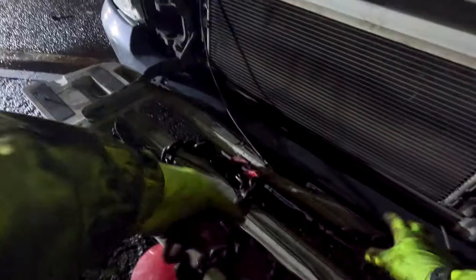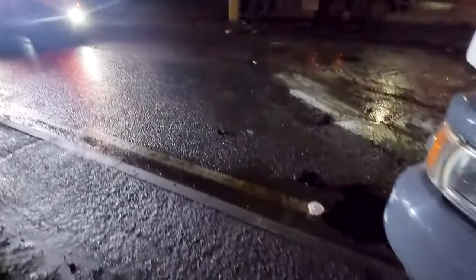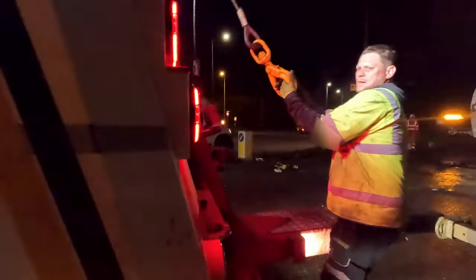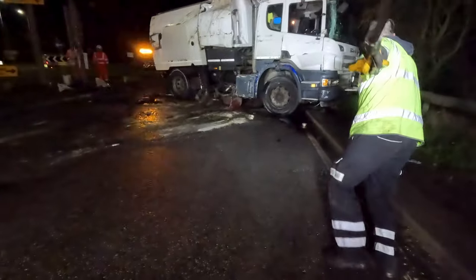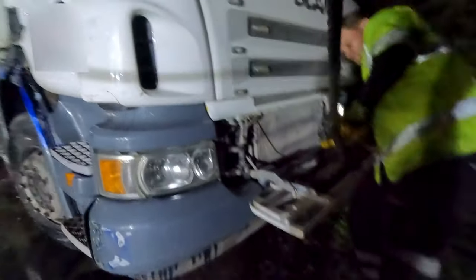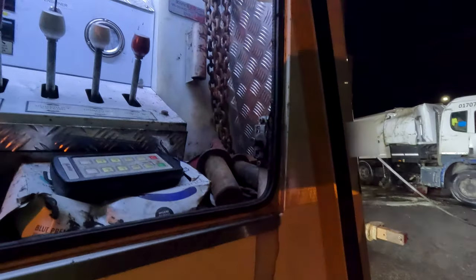Fortunately in this video it came over quite nice. It took air. The suspension wasn't great for some reason - it sat a bit skew-iff. But it was only going about 15 minutes down the road. One additional thing we had to do: when it came around the roundabout and flipped onto its side, it actually skidded across the road - which was actually handy for the rollover. But before we could bring it forward for recovery, we had to drag the front end around. Where it's facing now it's facing into the barrier, into the bushes - you're not going to get your trailer in there. So reach the cable back out, chain onto the front towing pin, and drag this 18-tonne around.